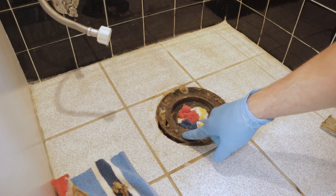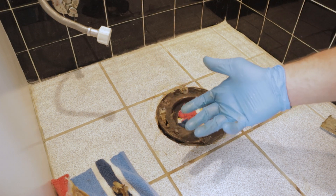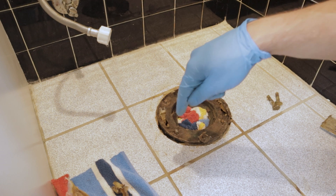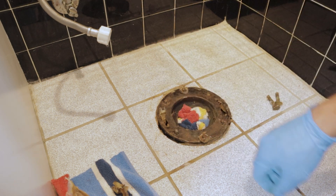What we need to do is remove one of these screws so I know how long they are. We're going to add some material underneath the water-damaged subfloor so that the new screws will go through the bad subfloor and then into some wood spacing I'll put underneath, giving this a solid bite.